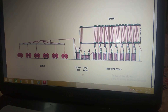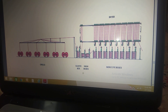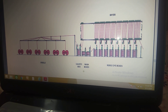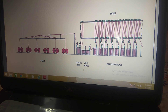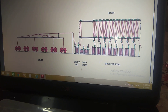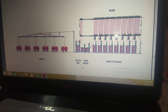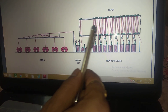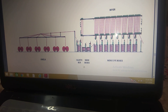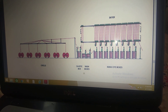The goods are then squeezed and skied for 2 minutes. This 2-minute skying is the air oxidation time, converting the leuco dye to indigo. The boxes are fed with a stock solution of leuco-indigo, and the liquor in the boxes is circulated to maintain constant dyeing conditions. This process of several dips and oxidation is then repeated in a second series of boxes, and several rinsing and washing boxes complete the process.